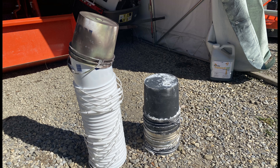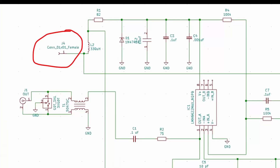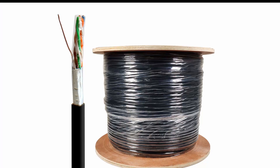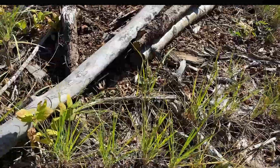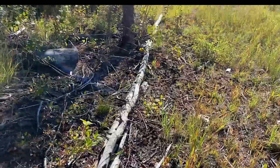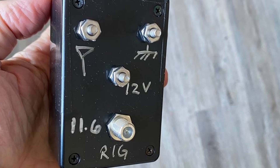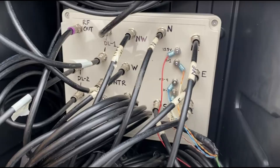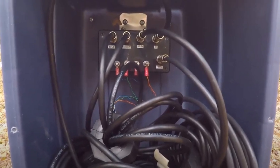I buy cheap plastic buckets from the building store and cover the feed point — I paint them camo color. The amps have a separate 12-volt supply. I've done this to avoid putting DC on the coax with a bias T because I've discovered this can sometimes lead to noise problems. I use Cat5 for the supply voltage to the field. Make sure you get direct burial Cat5 as well as direct burial coax, and cover your coax and Cat wires under logs or bury them. Deer will eat coax and Cat5 wire. Keep those F connectors clean and tighten them with a wrench, and flood your connectors with silicone grease to prevent moisture ingress.